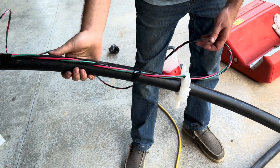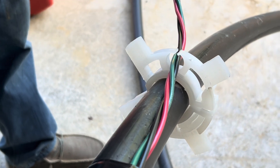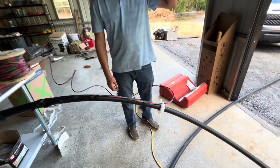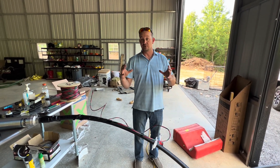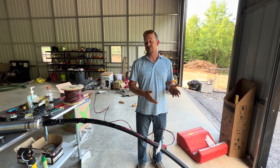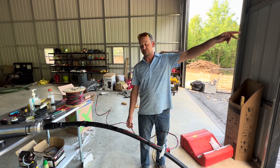Right here we've got a wire guard. Because of the yield of this pump and the pressures we're running, we're using inch-and-a-quarter pipe. We've got really long distances at the 41 Acres — runs to yard hydrants probably a thousand feet away from the wellhead. The larger the pipe, the less pressure drop, the less head loss, and the better the gallons-per-minute yield at those longer distances.